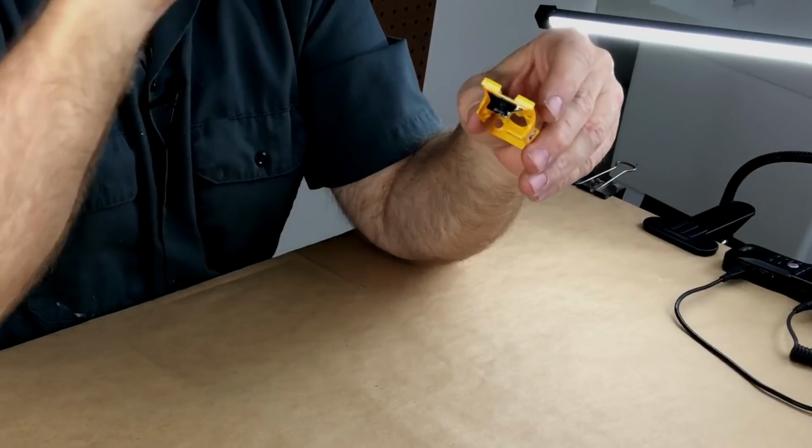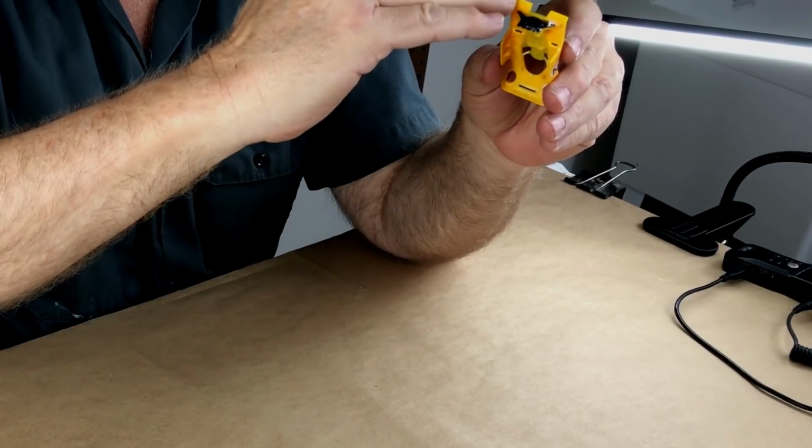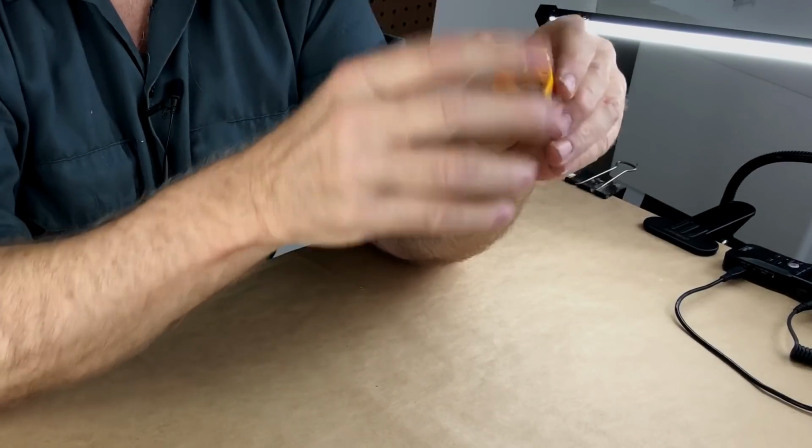And in fact, everything about it makes it very difficult because almost no matter what orientation you hold it in space, it's going to be hard to fill. And it's going to catch bubbles in multiple places. So, remember what the basic principle is. The principle is you have a cavity, you have a hole in a block of rubber, you pour the resin in, it runs to the bottom, it fills from the bottom up, and it vents out the top. That's the principle we're working with here.